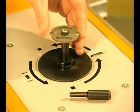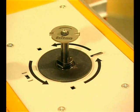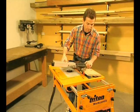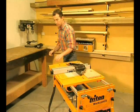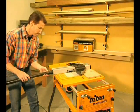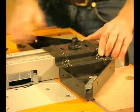This is a very popular accessory for the router table. You get a tungsten tipped cutter with both a quarter inch and half inch shank to suit all routers. The biscuit joiner is a real pleasure to use. Drop it into the router table, connect the dust hose, and use the adjustable guide to position your pieces in the way you want them joined.